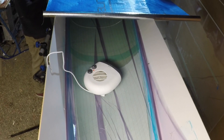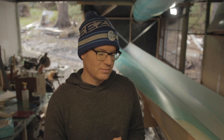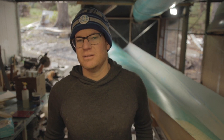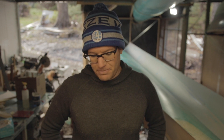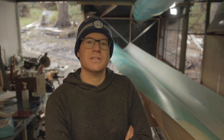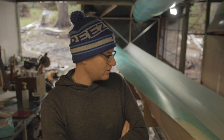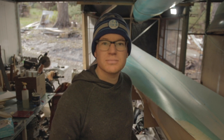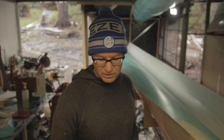That actually went reasonably well considering the few dry spots on the hull. The main issue was it seems to be impossible for me to get a good seal in the bag, which allows small amounts of air to get in and creates air pockets, so I've got a few areas of delamination to sort out. The second hull panel went a lot better — I managed to do it all in one go. Still had some leaks and a few areas of delamination to sort out, but all in all it went pretty well. You can see it here behind me — I just need to clean off all the PVC release film off the back and then I should be able to put them together and create the hull.